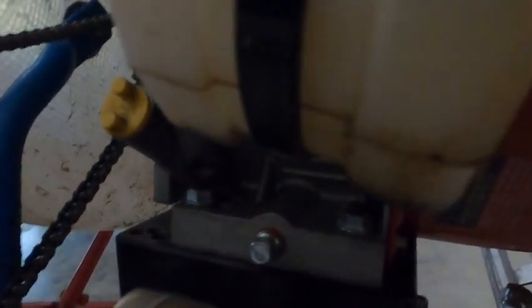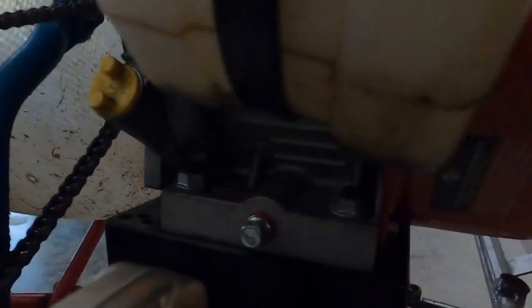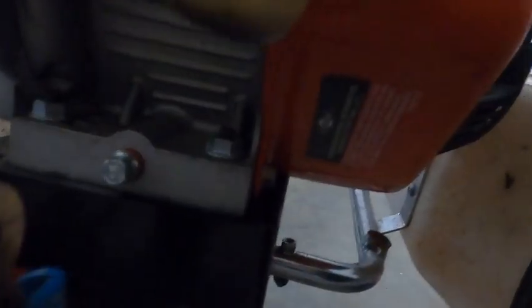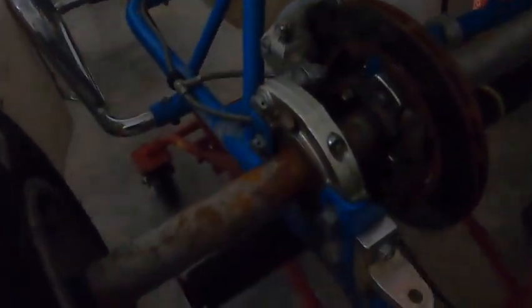There is also one last thing that most people miss. You sometimes want to drain this line. You drain this line by unscrewing right here. And you kind of want to also drain this. It doesn't really matter. It's just like your leftover water reserve, because any water that gets in the air filter comes through here and it sometimes puts it in here. But you want to drain that. You want to drain that almost after every practice.